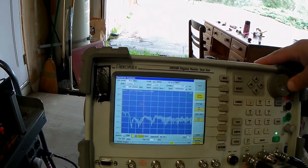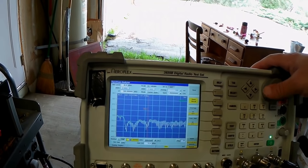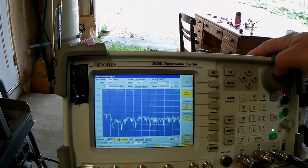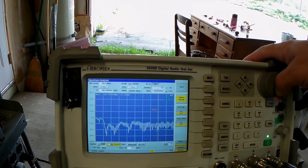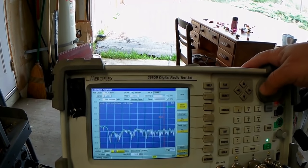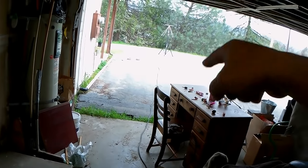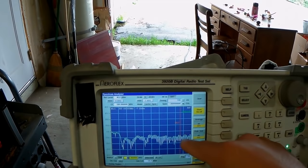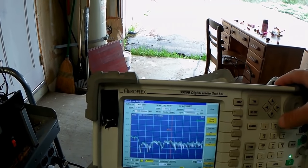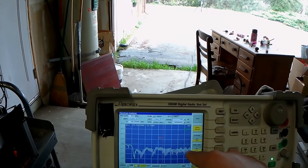In the 450 megahertz range, right there at 430 we've got minus 15; at 440 it's minus 18 - you're going to do really well there. At 750 megahertz we're looking at minus 11 and 800 at minus 16. All these little peaks and valleys is actually the ringing of the coax cable to the antenna, which has a resonant frequency of its own. Overall it's a good receive antenna throughout the band. At its worst it's minus 8, but this minus 10 line is the magic number and it pretty much averages just below it to be considered a good transmitting antenna.